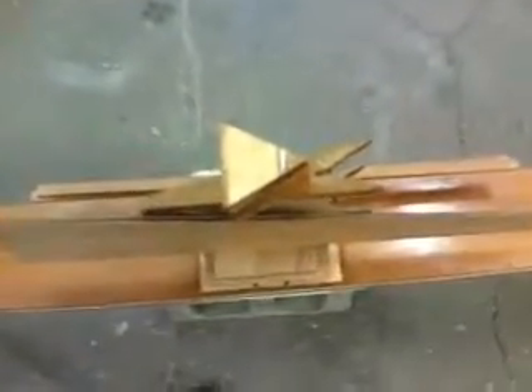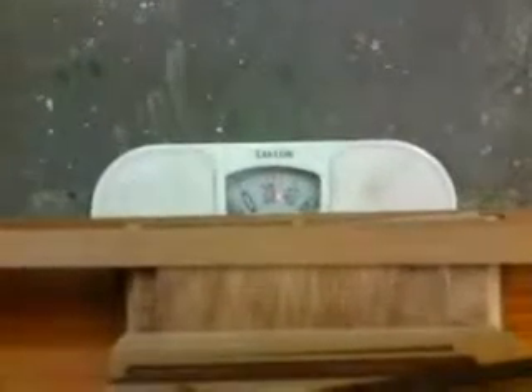I think we'll stack everything we've got so far on here and see where we're at. This is our stack of components, which are rough yet, not exactly the size, but reasonably close. Everything we've created so far — the sides of the boat, probably the heaviest portions, our curved pieces, our bow and stern blocks, and our bulkheads for the mast step — and we are coming in at about 23 to 24 pounds with this stuff.